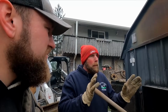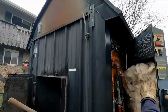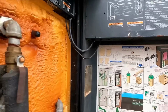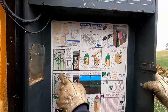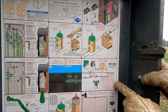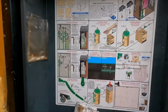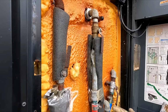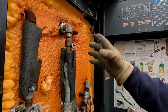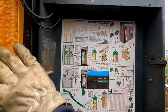There's some diagrams. We'll put up some diagrams. Actually, I think they might have something in here. Sometimes they put the pumps in here. So really, what's happening is, well, here they kind of show. Okay, so this would represent heated floor, the way our shop is set up, and the pump that takes that water there. So two of the lines go to the shop and two to the house. So you got four here. One's coming in, one's going out. And there's valves on them in case you got to do a repair for whatever reason. But anyway, the shop floor, it's all the same water.